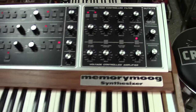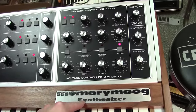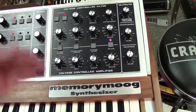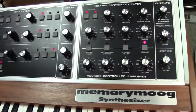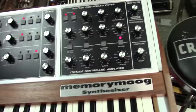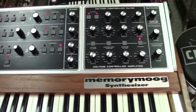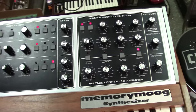One issue you had was on voice 6, oscillator 2. The thermal compensation wasn't very good on it. It would actually drift out. And I found out it was actually the Curtis chip, the 3340, which those are back in production. So I was able to put you one in it, and it works great. So oscillator 2 is now fixed on voice 6.